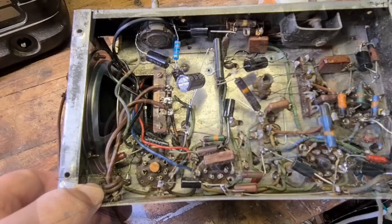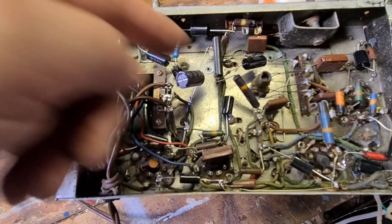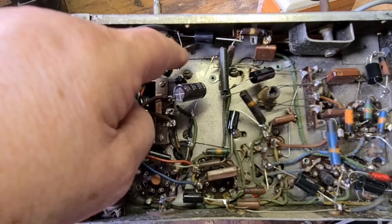I'll put this aside and drag out the Astor. Before I put it away I thought I'd have a look underneath — somebody's already changed the capacitors on this one. I can count five of them. That garbling noise is probably the main filter capacitors. These are all black capacitors — someone's bought them from Carl's capacitors, I would say.